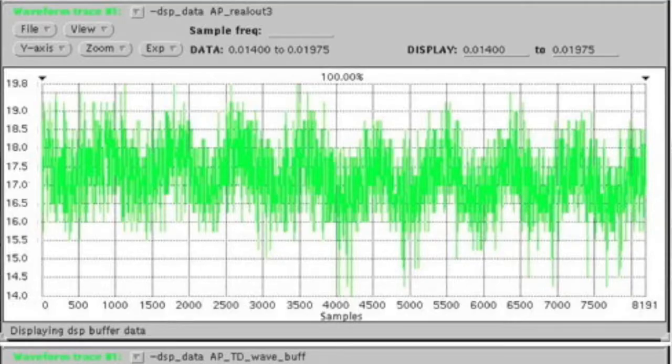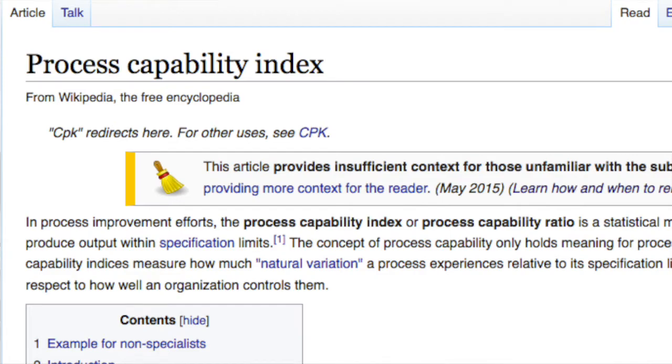And still, the noise was overwhelming, and so they had to reject the positive and negative peaks. I think the first or second positive or negative peaks they captured, and then they went with whatever peak they could find and worked out 0.707 times the peak. That's the RMS, and they said, oh, that's good. And the CPK, which is a statistical thing that you use to make sure that your test is valid and reasonable, was kind of iffy, but they went with it. So they took 4 million samples and got kind of okay CPKs.